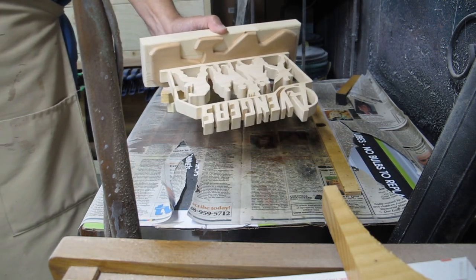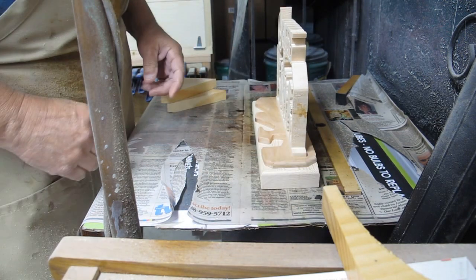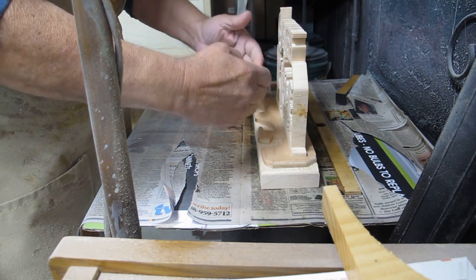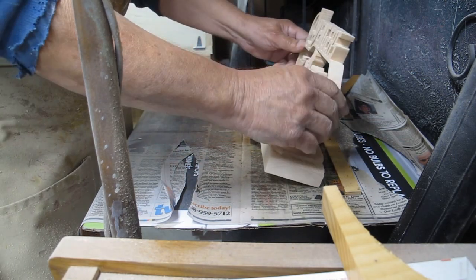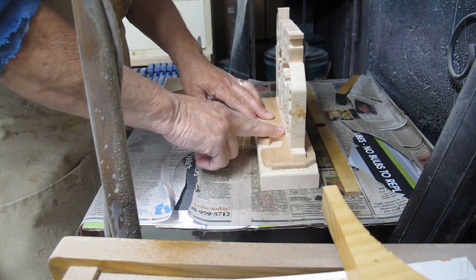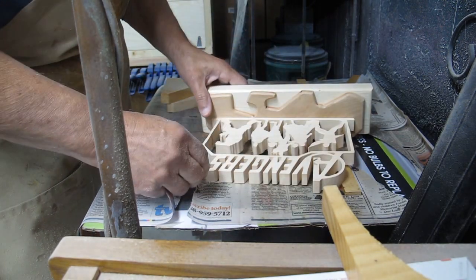The thing is, when you're spraying a sign, you don't want to spray it just standing up like this, because if you spray it here, it's likely the sealer, until it dries, is going to start to drip down and leave some ripples on your sign. It's okay if you do it very carefully, slowly, and don't put too much on, but you got to be careful about how much you actually do put on. So what I like to do is I like to lay the sign down.